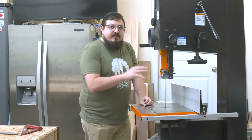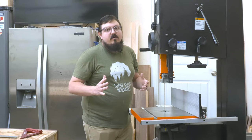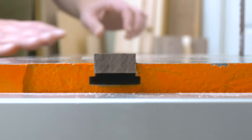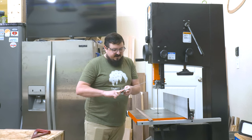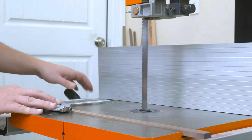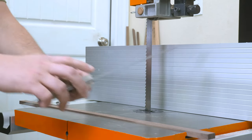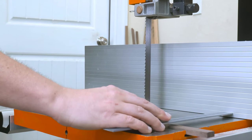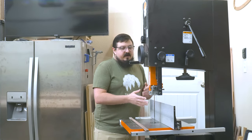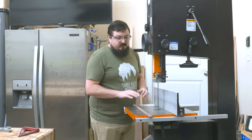The last alignment check is making sure the fence is running parallel to the miter slot, and that the miter slot, fence, and blade are all aligned with each other. To do that, I'm going to grab a scrap stick, drop it in the miter slot, set my square arbitrarily at seven inches against the strip, and check that it's touching at the back of the fence. I'll transfer that to the front of the fence — and we're good. The fence and the miter slot are running parallel, so long resaws or veneer cuts will run straight.